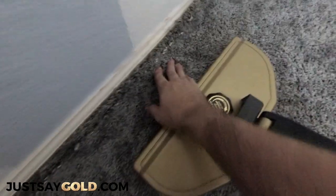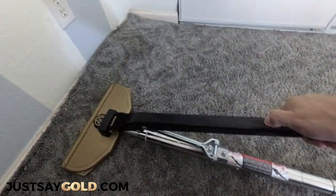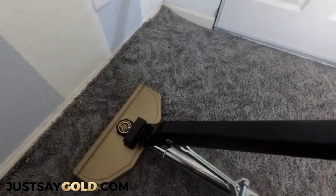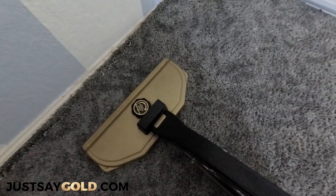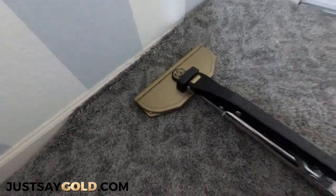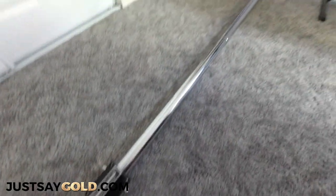What's nice about these stretchers is you can lock the handle so you can stop the stretch whenever you feel it's enough. But if you don't have that, you want to get a good enough feel of the stretch so you can push the handle all the way down right at the point where the carpet starts getting hard to stretch. I personally like having the handle down instead of locking it, that way it's not sticking up and in my way.